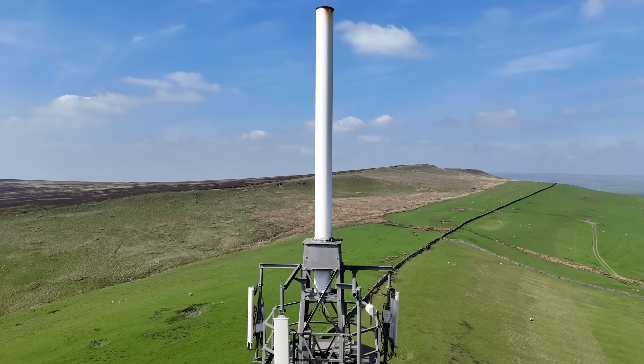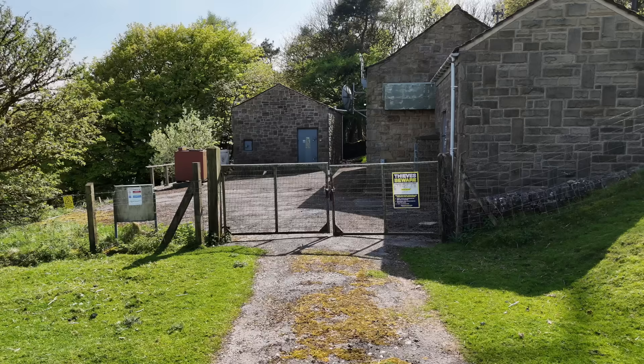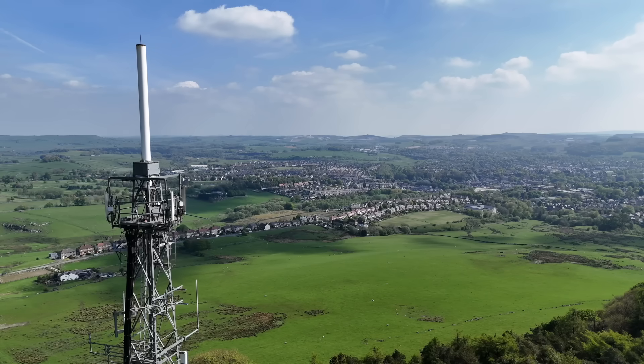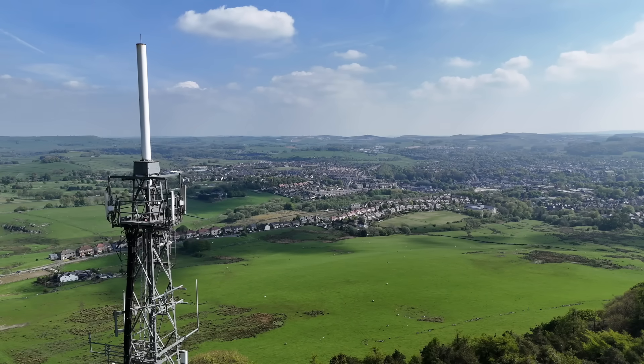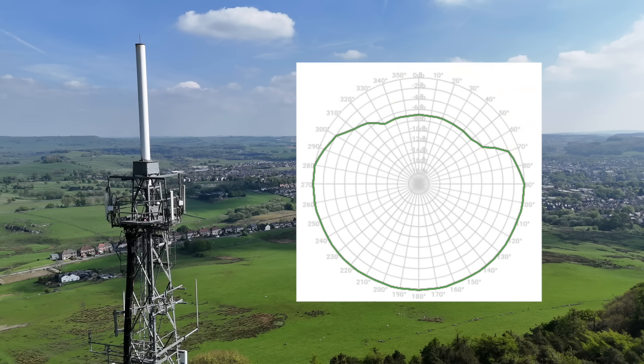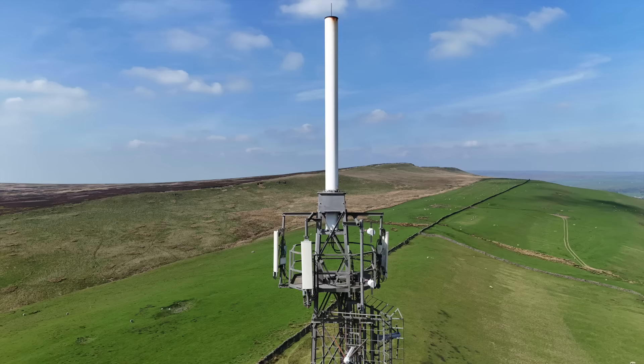The cylindrical structure at the very top is a classic example of a UHF television relay. In the analogue days there was a 1kW transmitter feeding the antenna, but today it's just 200W. The transmitter sends Freeview Television out on BBC A channel 27, D3 and 4 channel 24, and BBC B channel 21. You'll notice there's a lobe out to the south when we look at the radiation pattern — the town of Buxton lies within that lobe, so the signal from the antenna is concentrated in that direction.